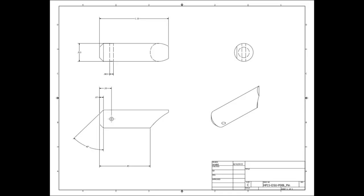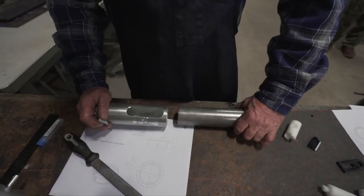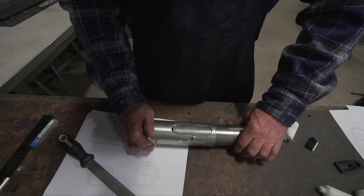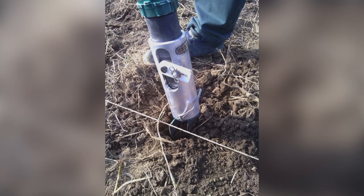You still need to fabricate the pin. Make it to the length shown on the drawing — it has a slight angle to it. Place a piece of Delrin the same size as the Delrin drum inside to get it vertical, then place the pin down and TIG weld it in. That completes the outer housing.